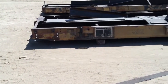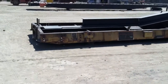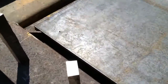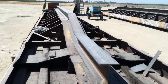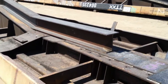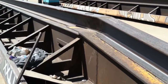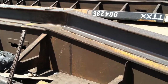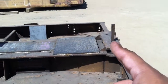As an alternative, instead of putting our abutment in the deep section or anywhere in the middle, we're actually putting our abutment way back to the very edge of the rail car — that's a pretty new concept for rail car bridges. We're going to use these steel plates underneath to stiffen up that rail car. What we do in order to achieve that kind of length is stiffen up the rail car with I-beams, and we have to run quite a few. We weld it all the way down, making that rail car stiffer and stronger so we can put our abutments all the way back over here.